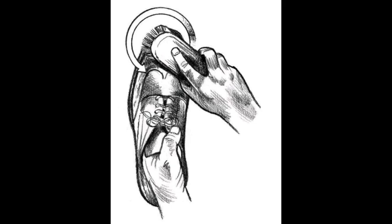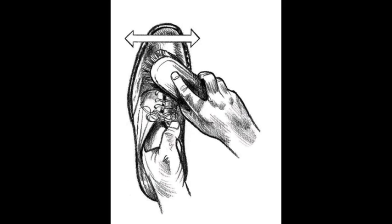Repeat if necessary. Inside, remove clutter, window shades, blinds, curtains, etc. Wipe windowsills with a damp cloth to remove dust and debris. Starting from the top, spray cleaning solution on the window or apply with a clean cloth. Wipe down glass to remove dirt. Squeegee or dry with newspaper, black and white, not colored ink, which won't leave streaks or lint like paper towels.